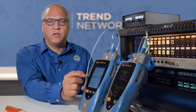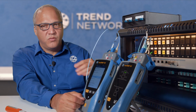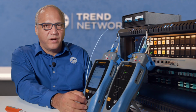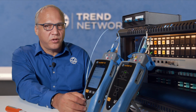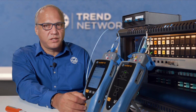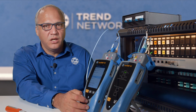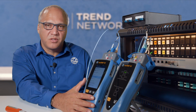So remember, you can do LC testing using the two jumper test method with LC to SC cords, but that isn't going to provide you with the correct amount of loss when the requirement for the project is to use one jumper testing, which is the case for most cabling manufacturers. They want to see one jumper calibration and testing, especially if there's warranty programs involved.